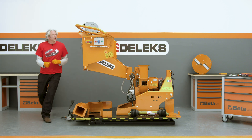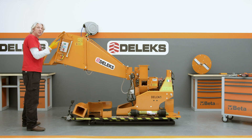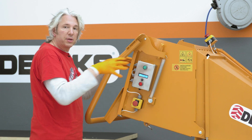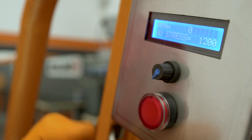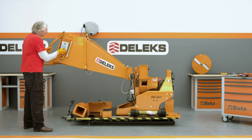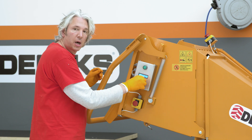You control the no stress from this controller. The green button turns the machine on and off, and the red button reverses the feed on the hydraulics so you can get material back out of the machine. The small button in the middle controls the stall speed of the no stress — wind it to the left and it goes down to about 1200 rpm, to the right up to about 2200 rpm. For a large chunky piece of wood you might set it lower; if you're more cautious you'd set it higher.